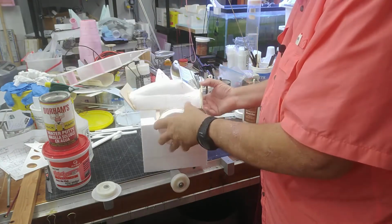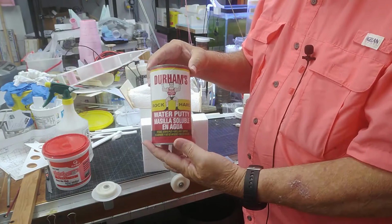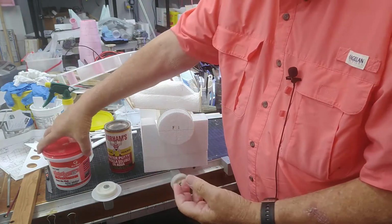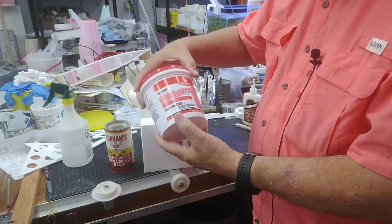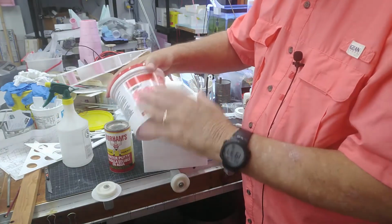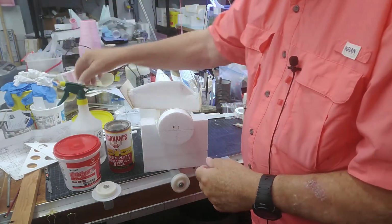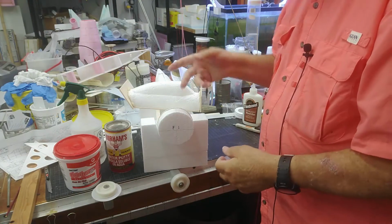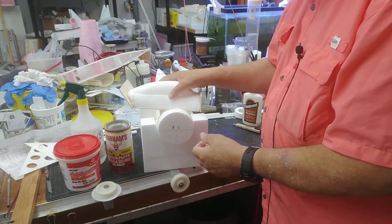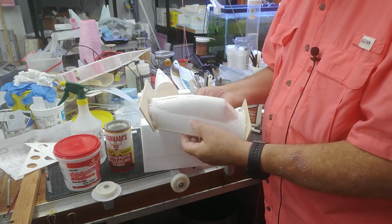We go back to our old standby, some Durham's rock hard water putty, some of the lightweight DAP or Red Devil spackle, and some regular old water. And you mix up the filler as I explained in an earlier video. You mix it up to the consistency of peanut butter.